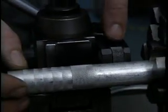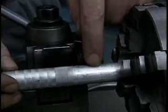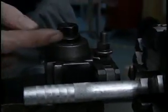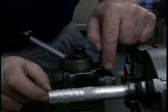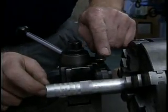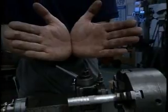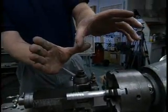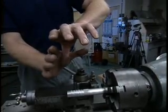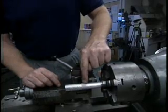Now, you will get this behavior, if you think about it, in almost every case, because unless the wheel diameter is a multiple of the diameter of the shaft, in one revolution, this tooth on the wheel won't come back to exactly the same place. And the way to avoid that problem is to plunge quickly enough so that you produce deep grooves during the first revolution, deep enough so you form V's that allow this wheel, even though it's not going to register exactly, to catch the V produced in the first revolution and then fall down in place. And after several more revolutions, some averaging takes place so that the wheel produces uniformly spaced grooves around the part.